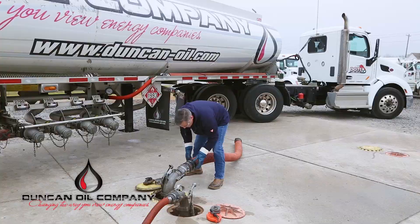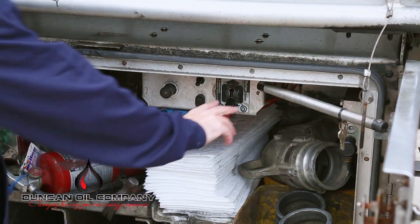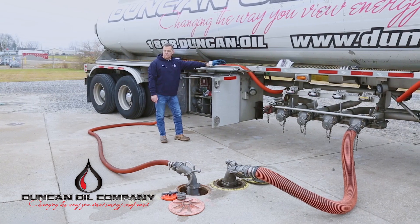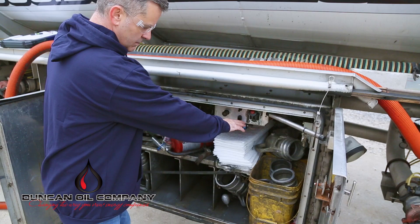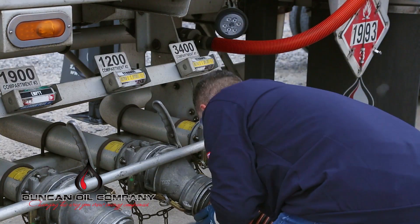Connect your delivery hose to the drop elbow at the fill adapter. Connect the delivery hose to the appropriate product compartment on your trailer. Open the manifold load head valve. Open only the internal valve for the compartment you are unloading. Once the product is visible in the sight glass of the drop elbow, watch for abnormalities such as product color, which may indicate incorrect product, or excess air, which may indicate improper or obstructed stage 1 vapor recovery. Remain within 25 feet of the control valves during the entire compartment delivery. Once the compartment is verified empty, close your corresponding internal valve and close the manifold load head valve.